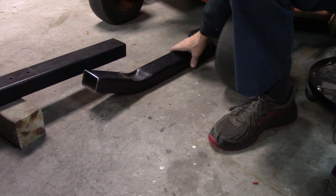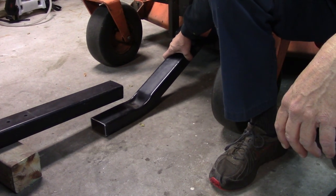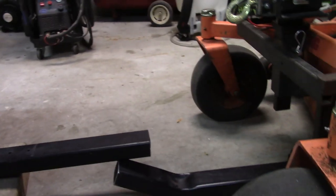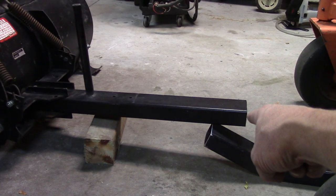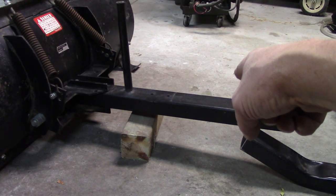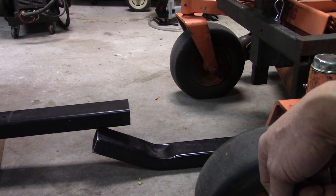You know how things go — sometimes you don't plan on it. I did not plan on what I just saw. Let's take a look at what just happened here. So when I cut this off from here — can you see that? I figured it was going to be about like this, but when I do that and look at about where it's going to be — as you can see, it puts it out past the tires. So my life just got easier. I'm just going to unbolt this, drill two holes in there, and bolt it up. Then just cut that bar off the tube once I get that all done so I can weld it up here. Life just got a little easier and this is a little faster.